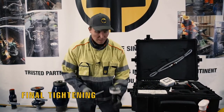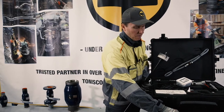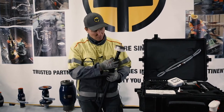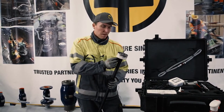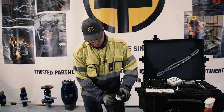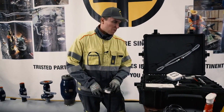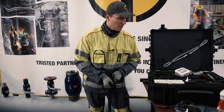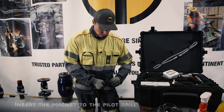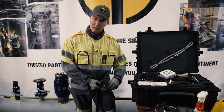Then make the final tightening. Because we are hot tapping into a steel pipe, we want to minimize the amount of waste that we get away from the pipe while drilling. That's why we want to insert a magnet around the pilot to get as much waste as we can away from the drilling. We have a center drill magnet which goes on the center drill and it's a really strong magnet.